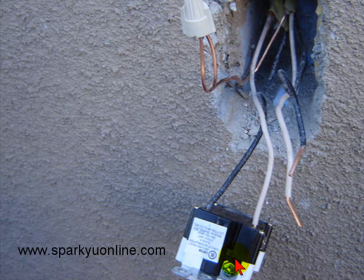Got the customer back up and running. This here is just the start of It's Beyond Me and you'll see more of these in the future, so keep an eye out for them. I don't even think this is acceptable for an apprentice — they should know that there's a ground screw and a ground pigtail that needs to go on that ground screw. Thank you.